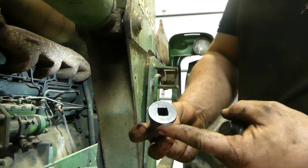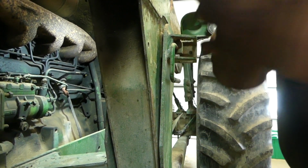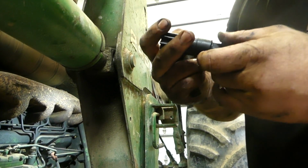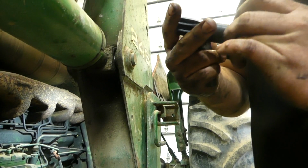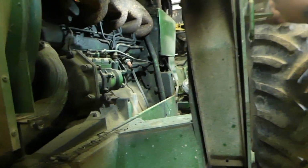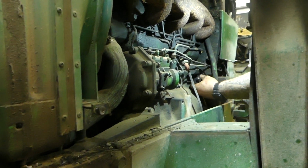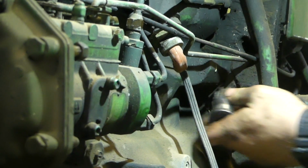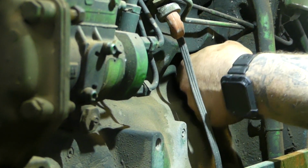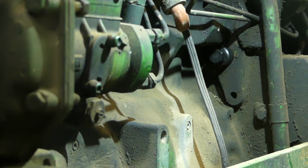This is the Cummins turning tool, 382-4591. And then this is the John Deere turning tool, JDG 83. It's made by OTC, but JDG 83 is the part number on it. I don't know which one will work the best on this one. I found that the Cummins turning tool has worked in a lot of places. This one it will not. Maybe this one won't work either. No. Oh, yep, there it is. You need the John Deere one for this one.